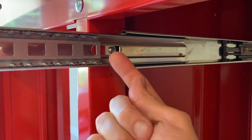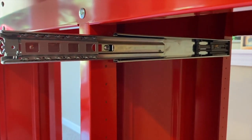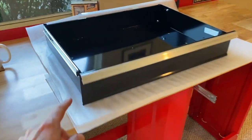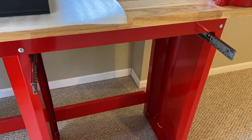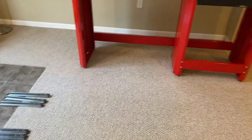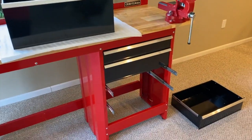As the screws go in, you might think they're spinning, which might make you believe you need a nut on the back end — just continue adding some forward pressure and those screws will catch the panel. You can then secure the slide rail in place. Top drawer is ready to be shifted in — carefully align the back edge inside those little inserts and shift it into place. First drawer is in.